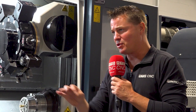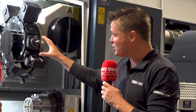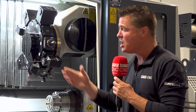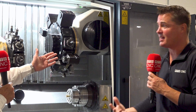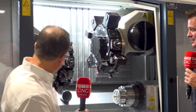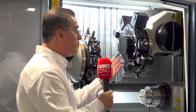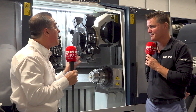In a lot of situations this turret is dedicated to the second side, and the first two are dedicated to the first side — being universal in that way doesn't exist in a lot of places. You can literally do two operations or pinch turning on one spindle while the other turret comes in and drills. I've got two turning tools here — one on the lower, one on the upper left — and the upper right has a drill. So I can be doing pinch turning or balance cutting, and at the same time drilling the center hole. That makes it a lot more efficient.